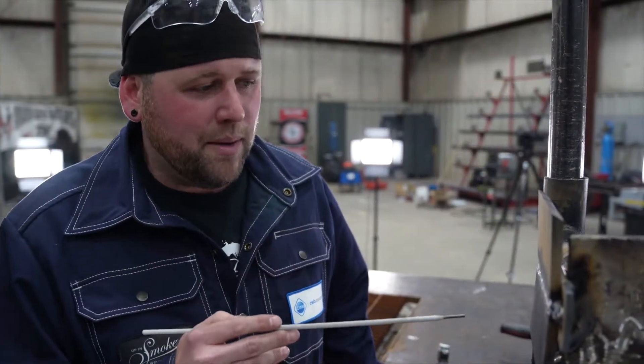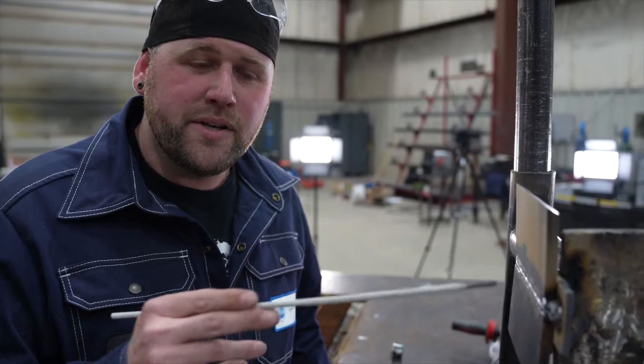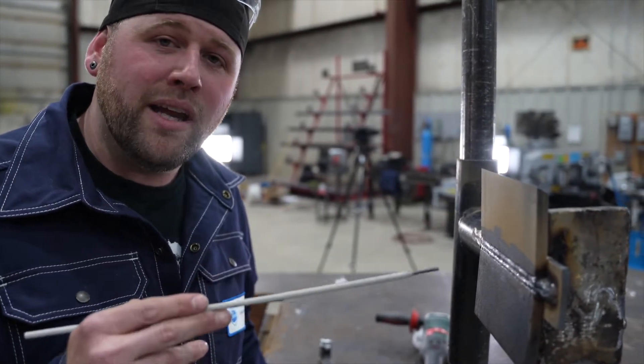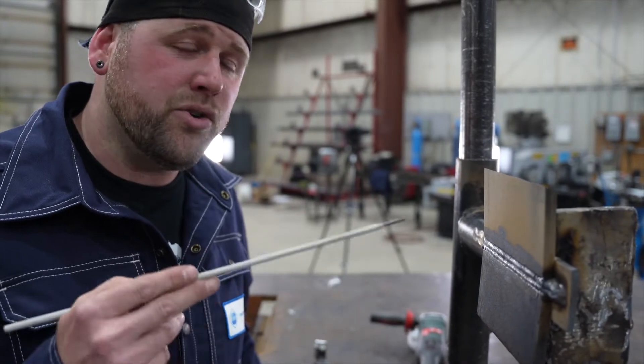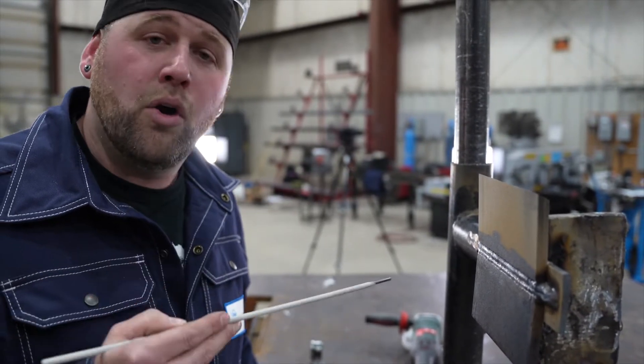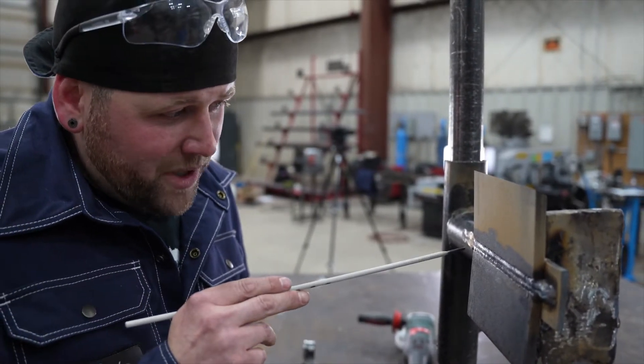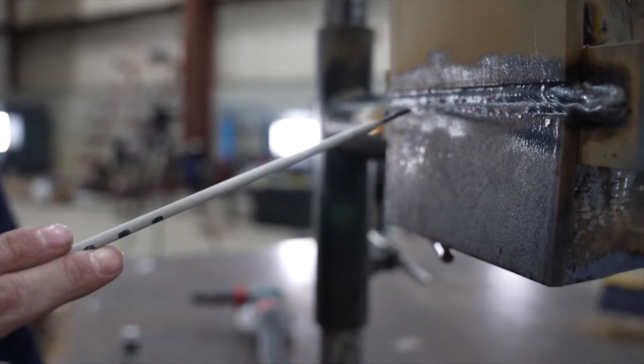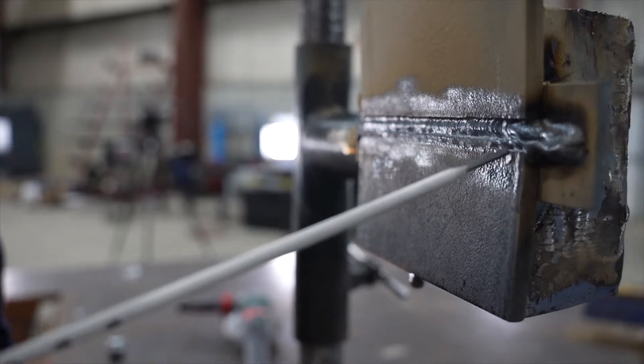I brought the coupon up to flush by running a series of small hot passes. You may have noticed the slag peeling — that's a good indication that your travel speed and position are going well. I've made sure to leave my bottom edge showing, as that gives me a nice line to follow when I go to cap it.